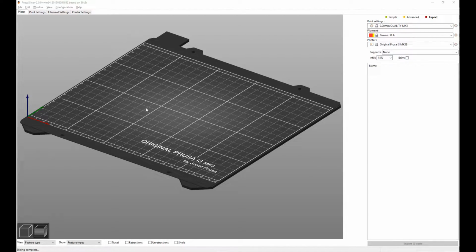P2PP is a replacement for the Mosaic Chroma tool. Chroma is used to convert a multi-extruder G-code file to single extruder multicolor. So it generates instructions for the Palette to tell it when to splice in the different materials and when to send pings back to the Palette. You could use Chroma with PrusaSlicer as well. You just slice it using multiple extruders and then run it through Chroma, like you could also do with Simplify3D or Cura or any other slicer that they support.